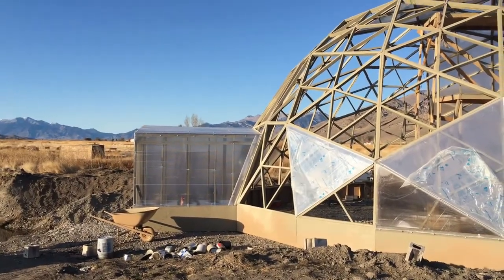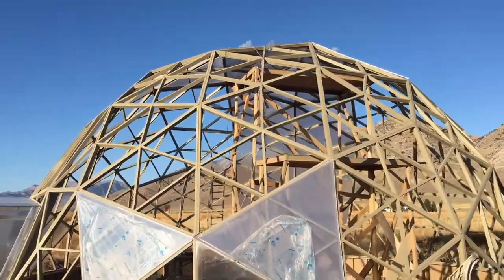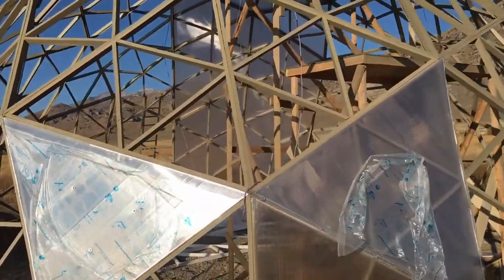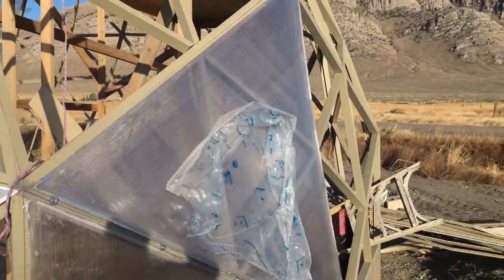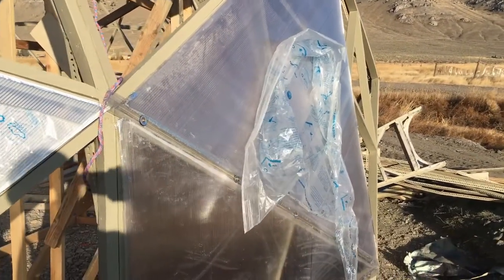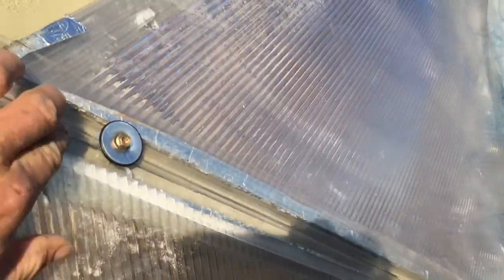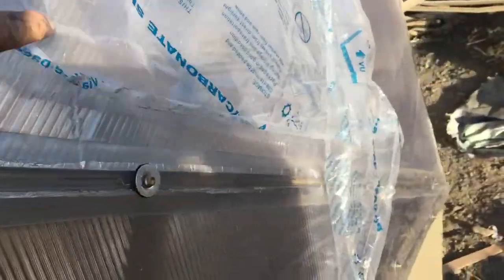I did the vestibule and got that skinned up last week, then worked on the top and one side yesterday in the snow — it was snowing and pretty cold. One thing recommended is to keep that skin on, but fierce wind can peel a little off. I also wanted to point out the H-channel: I just pound it in from the top and that fills the gap. It's a real pain, but easier than trying to stick them in.